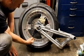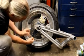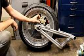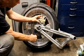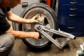As Jeff just said, we've got to make the mount on the swing arm a little bit narrower. It's quite fat. It's about 1 inch thick, which is too much. So we're going to narrow that down a wee bit, and then make a, and I'll probably have the caliper mount straight up, so it'll be kind of like about there. The thing is, you're going to have to adjust it, because of what will happen when you're doing the eccentrics as it's moving. We'll have some adjustment there.